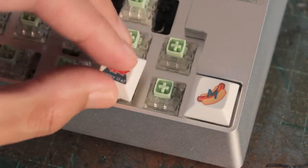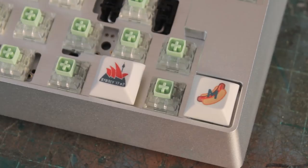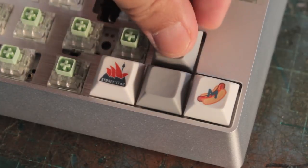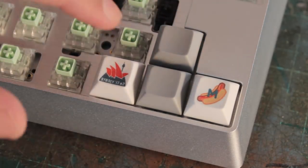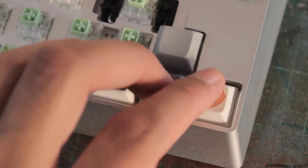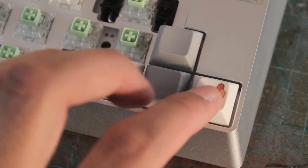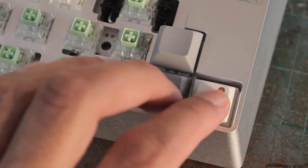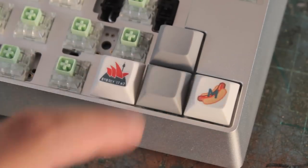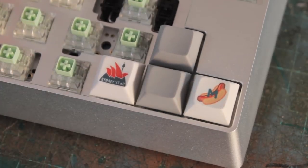And there's a load of movement with the plate, both laterally and also up and down. There just isn't any clamping pressure between the bottom and top aluminium pieces, and this makes the keyboard quite unusable in my opinion. You feel the movement when you're typing in all directions, and it just rattles like crazy. So I asked KBDfans about this, and they said to put some tape on the edge of the plate, essentially making the edge of the plate thicker to close that gap. So I went ahead and gave it a go.